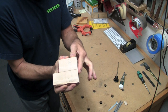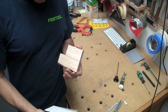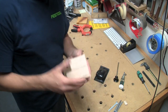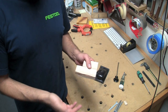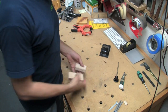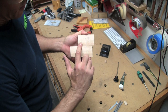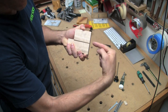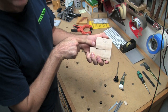I can ever so slightly feel an edge there. My goal is to be able to get these so that they're flush enough that I can take a sanding block with 180 on it and finesse and smooth it out — that's what I care about. You're never going to get this so perfect that there's no touch-up if you want it completely smooth to the touch. So that was the extent of the adjustment needed. Now the reason I told you to leave the blue tape on the back is for the case where your calibration ended up off. If you need to move the top piece towards the left in order to get these flush, that's the direction you need to move the cursor. And if it's the other way and you need to move it towards the right, that's the direction you need to move the cursor.